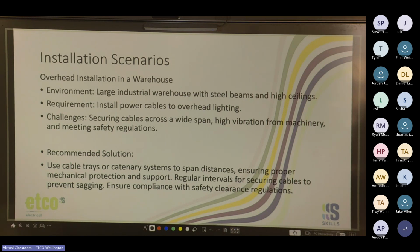I was told there was a rig for it. I haven't found it yet. But with cable tying on cable tray, I normally go every 2 or 3 rungs of the cable tray. And then for a cat wire, I tend to use my hammer as a measuring stick. I think someone tried to tell me it was about 300 or 400 mil between cable ties. I couldn't find a specific rig while I was looking this up, but I will keep looking tomorrow probably.